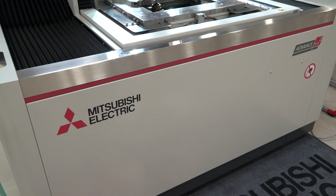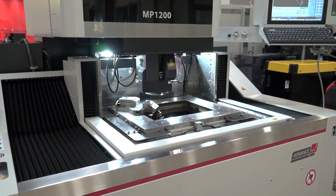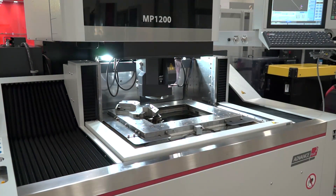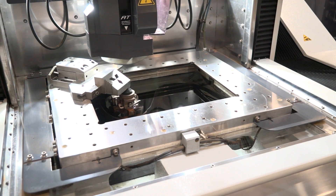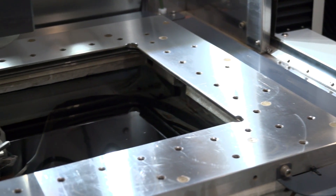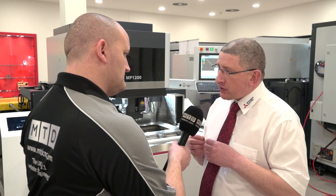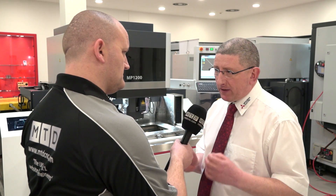What we do now is ramp things up a little bit. We have cooling all through the machine casting. The caged bearings are not only larger and stronger but they're individually sealed. Most bearing guideways have bearings running alongside each other, which creates a little friction. What we're trying to do here is grab every last micron out of the machine in temperature stability and straightness.